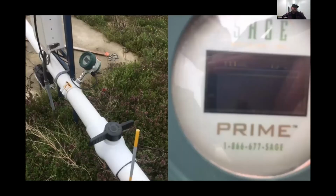There's another picture. This is your flow meter. This is what's typically used in both systems. And our flare system that we provide has this flow meter, which has an accumulator on it, the totalizer. You can also hook this in where remote monitoring is possible through cell service, and a data logger is possible, where you can not only accumulate the total flow, but you can have temperature for total destruction through the information from the thermocouple.